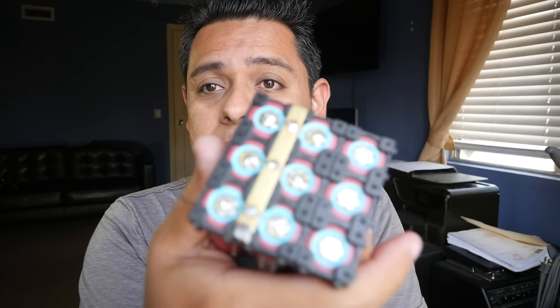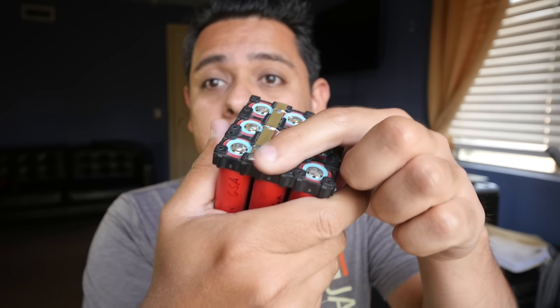Because we're using recycled cells, they're near the end of their life. These cells are old — past 70% of their original capacity. You don't want to run them too hard, at least not if you want them to last. So a 6-amp fuse link is plenty — that's a good level, well above what you actually want to draw from these cells.